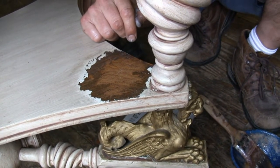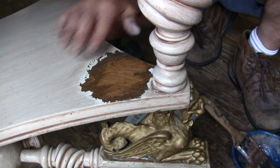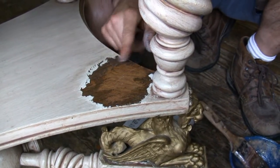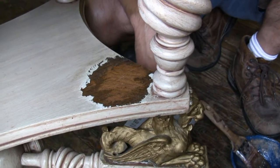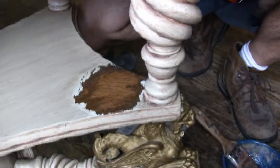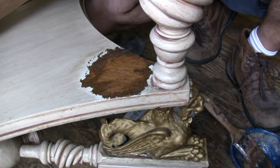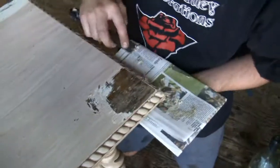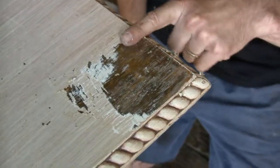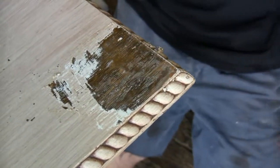The only way to get that out is by using coarse steel wool with a little bit of alcohol — that'll actually pull stuff out of the pores too. I don't think you should go that dark anyway. The color you saw underneath — yeah, I like that original color; that's what I really want. That's even a little light. I like this secondary oak — it looks like old oak. I've got some reference pictures I'll show you. There's almost no finish and then they just put the paint right on top. You feel that sticky stuff? That's a little bit of old varnish, but not much.